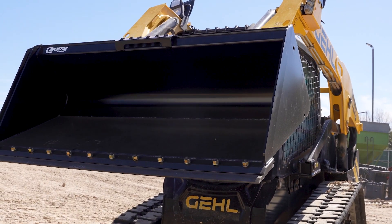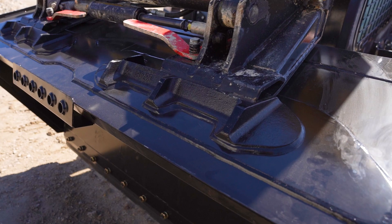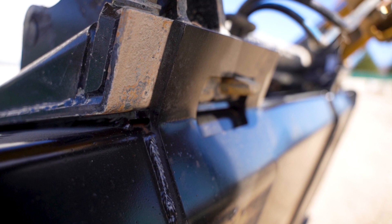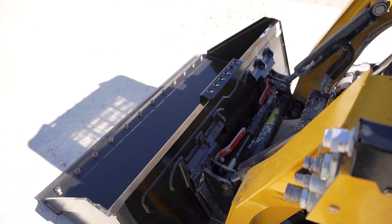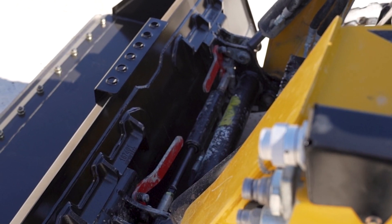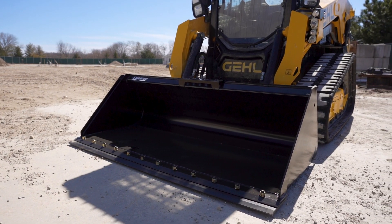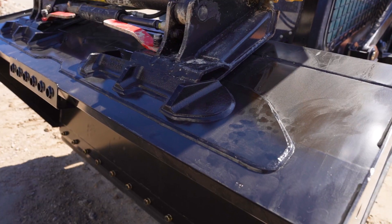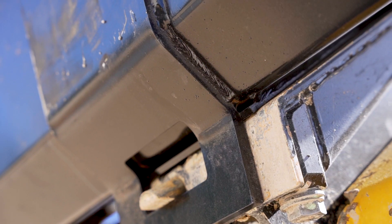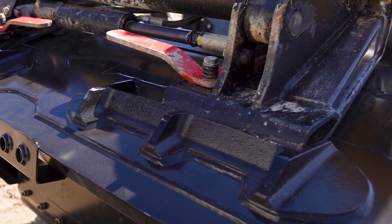Working our way to the back side of the bucket, you'll see some of the more important features as well. We put quarter inch thick kicker plates down near the bottom of the quick attach hookup to further protect the bucket. We have a quarter inch reinforcement strip that runs across almost the entire top length of the bucket, reinforcing the top quick attach. We also feature all steel cast upper brows for the quick attach, so no more bent upper quick attach over time. It keeps your interface and connection to the bucket — another great feature.